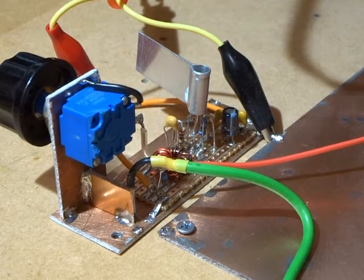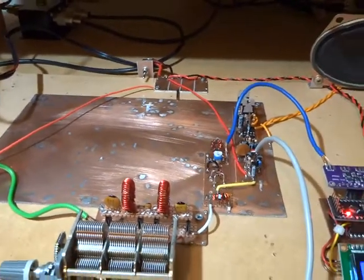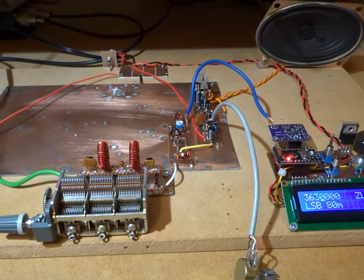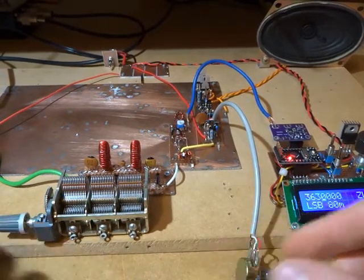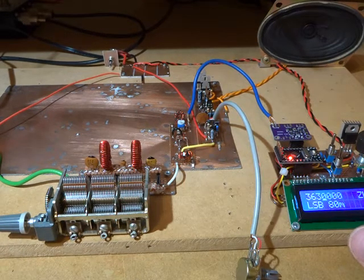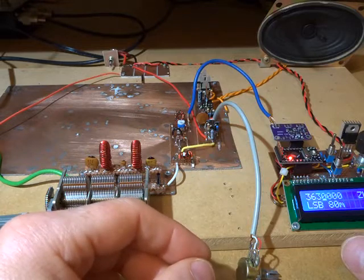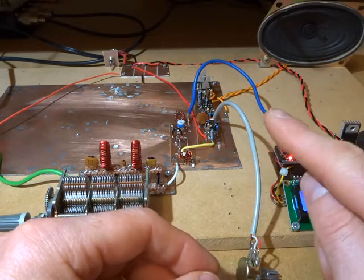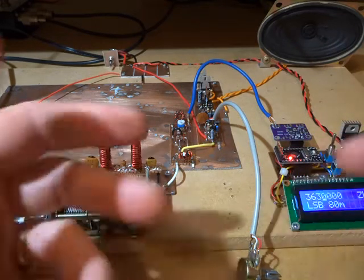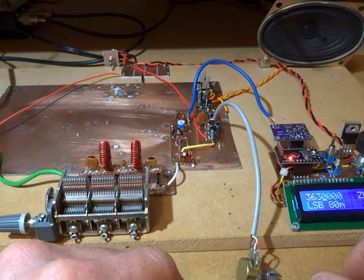What I think I will do is continue working on the radio in terms of the IF filters, and later on I'll double back and have another play with the RF amplifier. I may go for either a discrete 2N3904 or maybe a BC547, or may even do a couple of J310s and have a variable DC voltage on that second cascode J310 to set the gain. But this is all about experimenting and having fun.